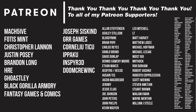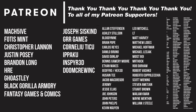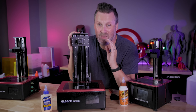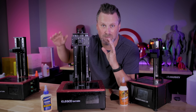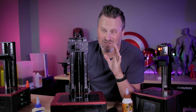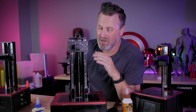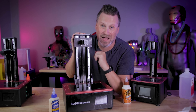I also want to say a big thank you to all my Patreon supporters for your continued support. If you're interested in more information about my resin 3D printer settings, you can find those over in my Patreon. And if you have an alternative way of cleaning off cured resin from your resin 3D printer screens that you like working with, let me know in the comments down below — hopefully that will help some other folks out there as well. But if you end up in that situation, a plastic razor blade and some isopropyl alcohol is probably the best way to go about cleaning it up, aside from just entirely replacing the screen. Thanks again for watching and I'll see you next time.